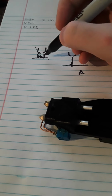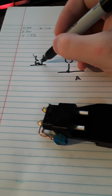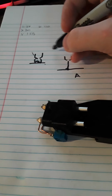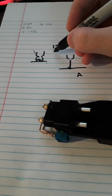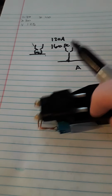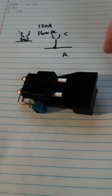And it ruins the workpiece, and it destroys the features that you're machining, and in my case, it also destroyed the power supply because I guess this all converted to plasma, and then it became very conductive, and my power supply was destroyed. My power supply is a rectifier, so 120 AC, and I convert it with a rectifier to 160 DC with also some capacitors in there. And so this nozzle will not work because I can't get a good seal, and now I also have to build a new power supply. I can get rectifiers off Amazon, so I can build a new power supply that way.